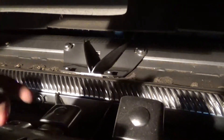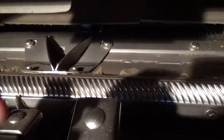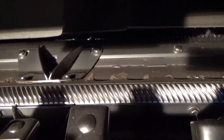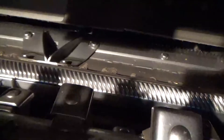That will spin forward. You can see these V shapes here — those help to start pushing the crop, separating it to both sides for the rotors, which we'll get to soon. But this drum here spins and does most of the threshing. This actually grates under it, which the grain falls through. You can see the feeder house comes up, goes into the APS drum, and then it goes into the main threshing drum.